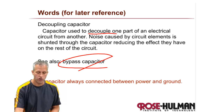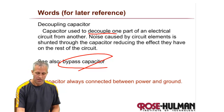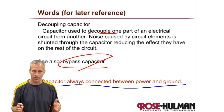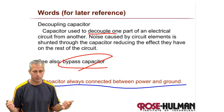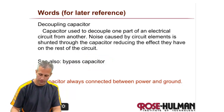They're also called bypass capacitors — you'll see that name used if you look these things up. They're actually quite easy to use. They're simply a capacitor that connects between power and ground, so you never have to debate about where to put it. One leg goes into power, the other leg goes into ground. Pretty simple — if you just remember that alone, you'll be getting pretty far.